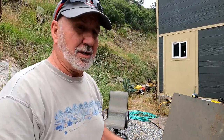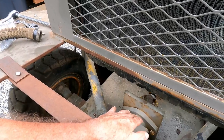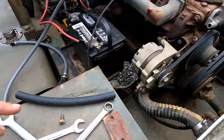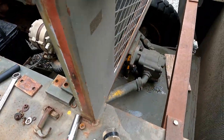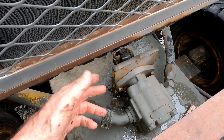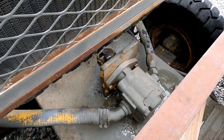We've had two rainstorms that I had to go inside for. A friend came over and actually helped me put the hydraulic pump to the drive shaft back in. Earlier in the video, I had to take this off and pull this out to release the shaft. The reason is that all of these belts have to go outside that shaft. I had been dreading that project because there's a keyway in there — this pump will free spin, but that one won't spin easily. You have to get them lined up, spline them together, and then put everything in, which was not going to be easy.